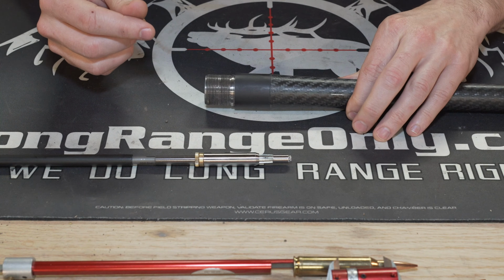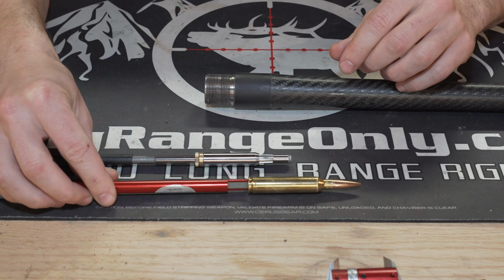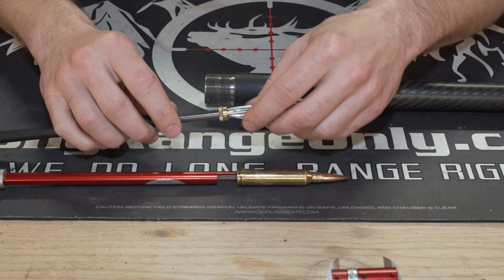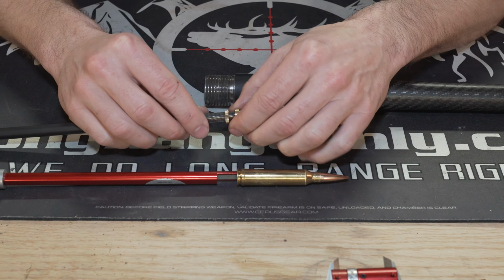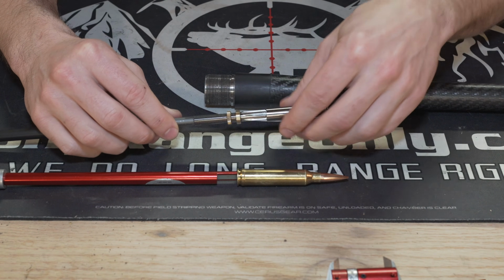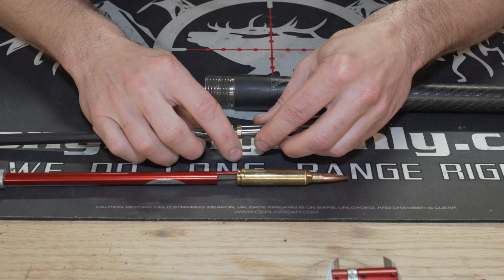We used Powder Blast, and then you're going to oil it really well. Take a measurement with this, and I recommend doing this every single time you make an adjustment and another cut. We went at 25/1000 increments, so you'll back this out. Again, looking at your mark that we made on it, back it out one full rev, which is 25/1000.